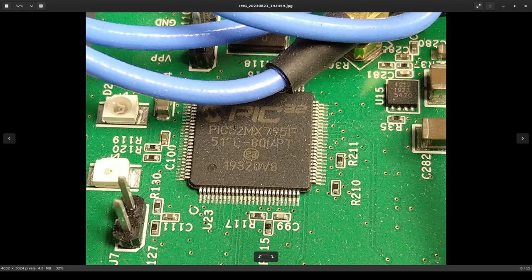All of the front panel connectors use short lengths of coaxial cable connecting from the front panel jacks to SMP connectors on the board, vertically mounted for all of the high-speed lanes. Down in the bottom left corner, we have the main processor assembly — a Microchip PIC32-700 series. These are an older MIPS 4K running at 80 MHz. Not super powerful, but it doesn't need to be — all it's doing is manipulating registers on the chip that does all the work.